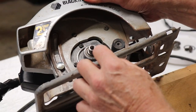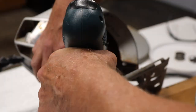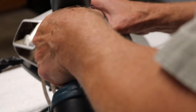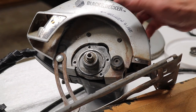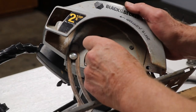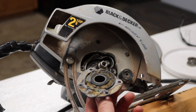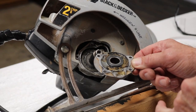Now we're into this part, which is the cover plate over the gearbox. We can just go right in and take those four screws out. This was all gunked up and I had to brush it a lot to clean it. You definitely want to make sure you don't have a bunch of sawdust that's going to get inside this gearbox once you pull this off. Notice I didn't have to take anything else off — just straight into the gearbox.